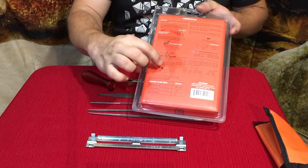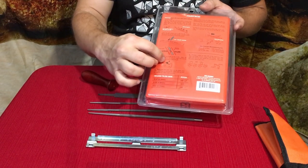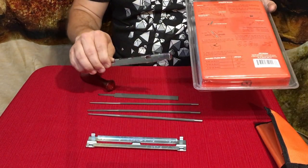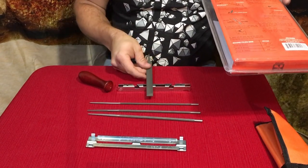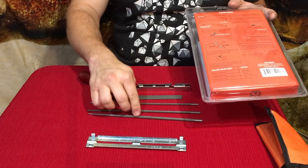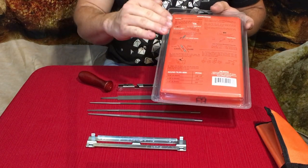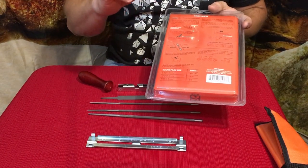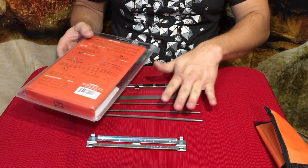You can see right here on just one link — you've got the front piece that clears the chip out, and the back piece which is the actual blade. The files sharpen the blade, but you also use the flat file as a gauge. As you file the cutting teeth down, that front piece gets relatively higher, so you need to file it down too to maintain the proper depth of cut.